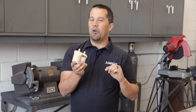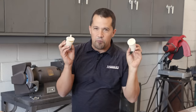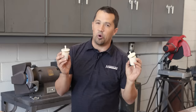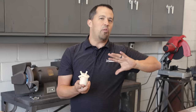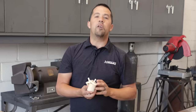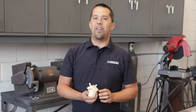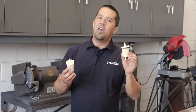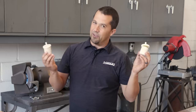We'll pause here and point out that as we go up in horsepower, the quality of fuel filters becomes really important — particularly when you start talking common rail fuel injection and DEF and DPF filters on larger equipment. The quality of the fuel becomes phenomenally important, and we do see mechanical issues caused by running poor quality fuel filters. On this small engine, though, it's not a place I would have concerns.